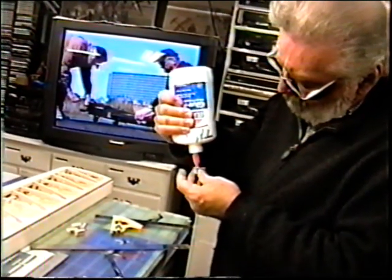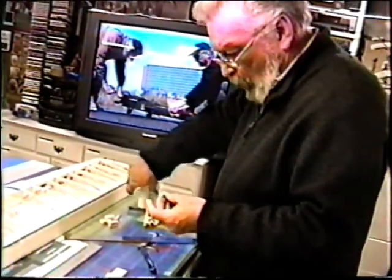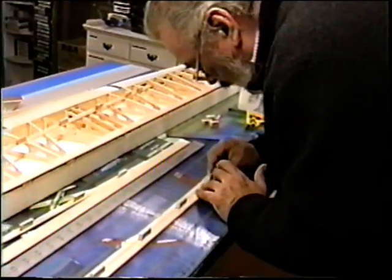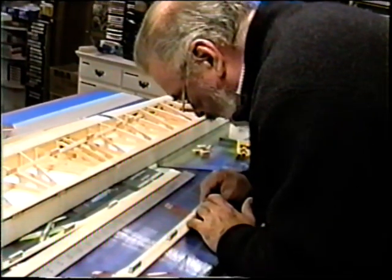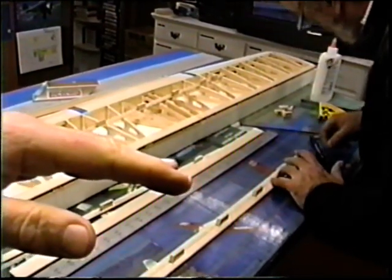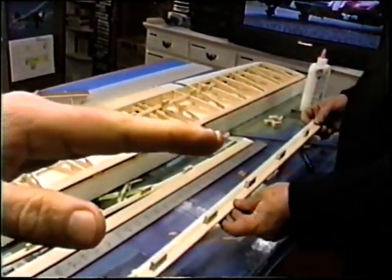Where's that piece of cord? Trailing edge now. The 3/32 that I found. Okay. And I think when we jig this and glue this trailing edge on, we could dry jig it on and then go to lunch and it'll be dry when you come back. Well, that's what we're after. Whenever you have a bow, what you try to do is put it in the opposite. In this case, it's going up. We'll jig it so it's down the same amount and hope that the rear springs back.